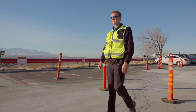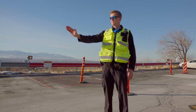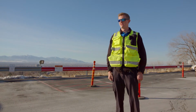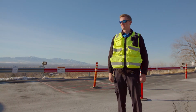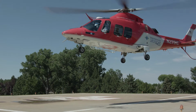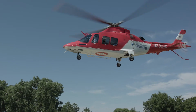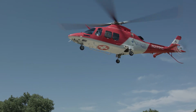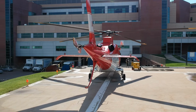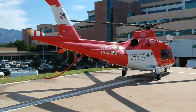During flight operations, the helipad needs to be free of all traffic in a 100 by 100 foot area and marked off with heavy markers that won't pose a FOD hazard. Restrict helipad access to vehicles and people anytime the helicopter is arriving, departing, or waiting to depart. Only assigned ground and flight crews ought to be permitted on the helipad whenever there is a helicopter present, especially during arrival and departure. Operating around an active or static helicopter can be dangerous for ground crew and aircraft alike, and so safety around the helicopter is of critical importance.